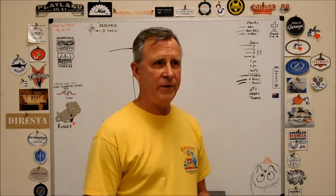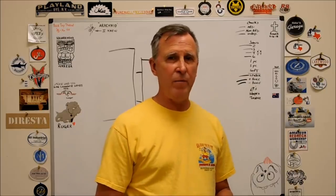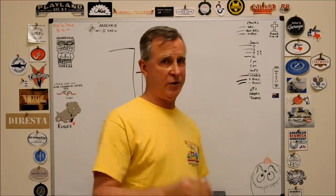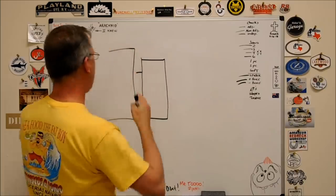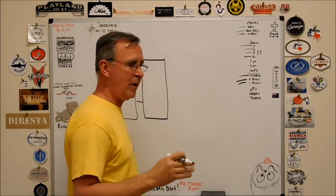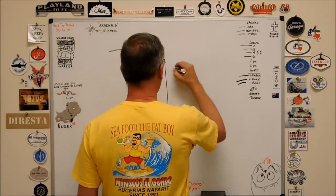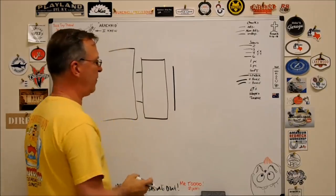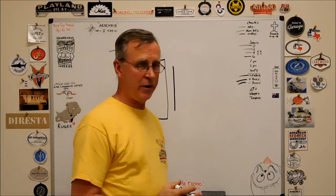Machine. Now let's talk about a little different kind of distortion. Instead of the 3-point, 4-point, 6-point, whatever bore high spot distortion that I mentioned before, let's talk about face distortion. When you squeeze a part in a chuck, we're looking down on top of the machine now. You got your thin parts. This is predominantly present on thinner material. Got a nice plate you want to hold in that. Life is good, right? As soon as you squeeze that, it's going to go one way or the other because that material's got to go somewhere.